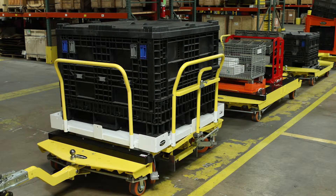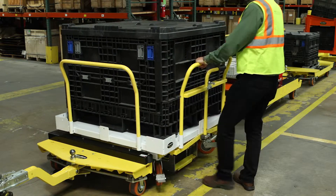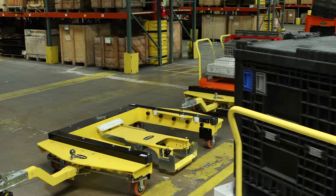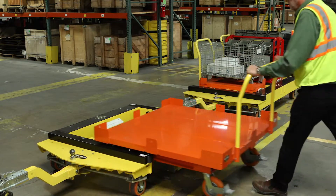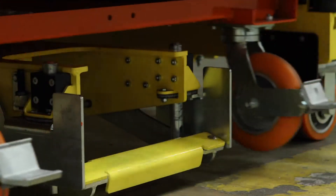Thanks to JTEC's exclusive and patented Elemate technology, daughter carts are unloaded from their mother carts almost effortlessly with a gravity-assisted unload feature and just as easily locked back into place on the cart with a safety-locked pin system. This valuable technology allows daughter carts to ride up off the floor when being towed, drastically reducing replacement caster costs, noise, and assuring safe, ergonomic maneuverability with one rigid caster always facing forward on each cart.